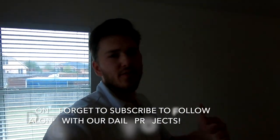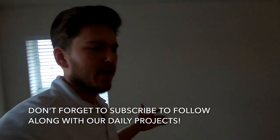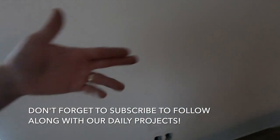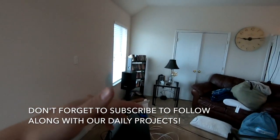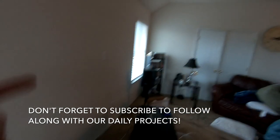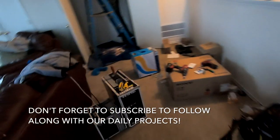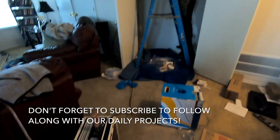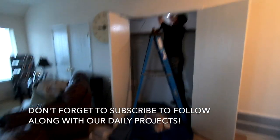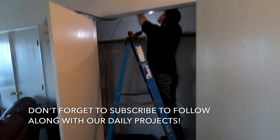This project is extremely complex and there is a ton of wiring. It's pretty much impossible to show you everything, so I'm just going to give a recap of what's going on. We got data and coax here at the front of the room and I'm toning it out, because it's running through the side of the wall into the attic next to this room — and these two attics don't connect. So I'm going to go on the other side, snip that line, and splice it together with my CAT6 and coax, running those through the wall where our AV rack is going to be to get everything connected back to the router. Grayson is working on putting in a hole for our coax, data, speaker lines, and HDMIs.